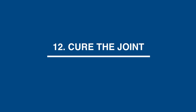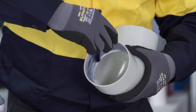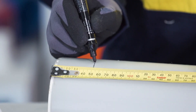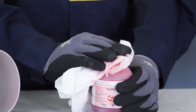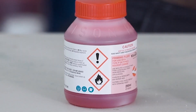Step 12: Cure the joint. Joints cure faster when the humidity is low and the temperature is high. Please consider your health and safety by always using correct PPE gear to protect your skin and eyes. Solvent cements are toxic and have highly flammable vapours, so don't work in unventilated or confined spaces and keep away from naked flames, sparks and hot surfaces.